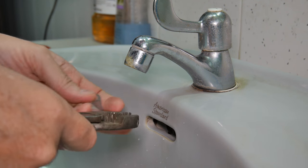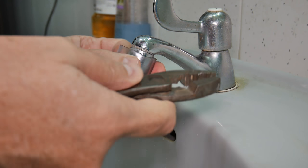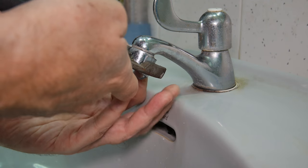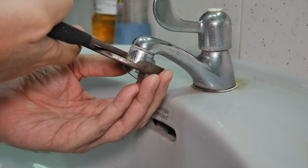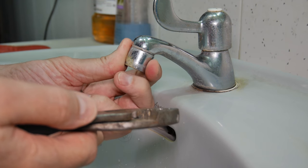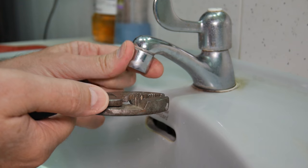If you really must use your pliers, then get something substantial to protect it - like this piece of soft plastic tubing. It'll do a pretty good job of getting a grip on here. Make sure you don't grab the bare brass, and use the absolute minimum grip necessary. I've also used a lot of wrappings of damp paper, but that's high risk - you're likely to squeeze too hard and deform or crack it.